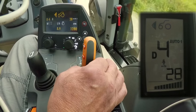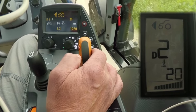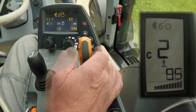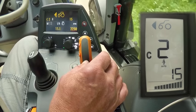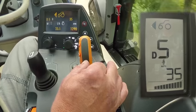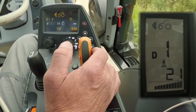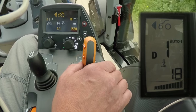Moving the gear lever to the left gives manual mode. By pulling the lever back we get a lower powershift gear and less speed. If in D range and we pull the lever back, we can automatically go into C range. If driving in manual mode in C2 and we want to accelerate as quickly as possible, just push the accelerator and push the gear lever forward and hold it — the tractor accelerates quickly all the way up to D5. The same applies if you want to slow down rapidly: keep the lever pulled back and the tractor decelerates quickly with the help of engine braking. We recommend using auto 1 when driving on the road. You can also use auto 2, where you can set the engine revs to automatically control the gears when changing up or down.